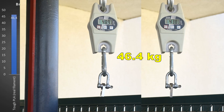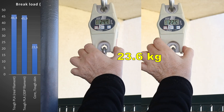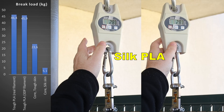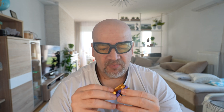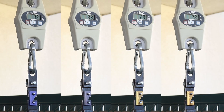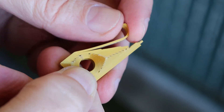The layer adhesion test — I am recording the break load, and on the left side you can immediately compare the numbers between these materials. The order is exactly what I expected. I only thought that the core type would be much closer to the tough PLA materials. This tough-silk PLA core filament is a good simulation for layer adhesion, but for the hook test not really — because theoretically the carbon fiber core is stronger than the skin, whereas in this case silk is weaker than tough PLA. But the results are interesting: stronger hooks are maybe a result of more tough PLA in the cross section, and even with hooks the wall and layer adhesion are very important.